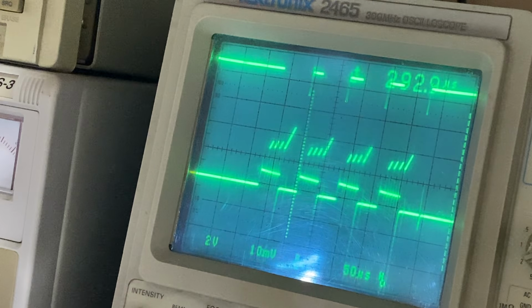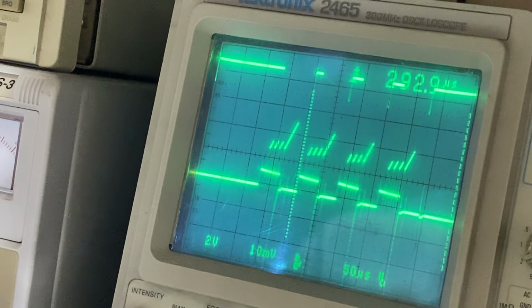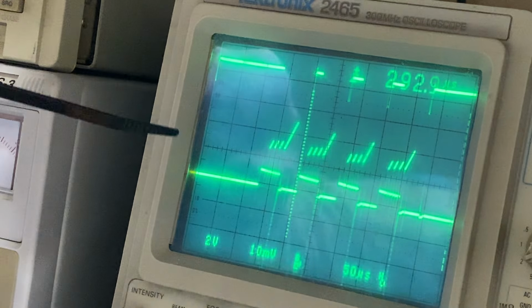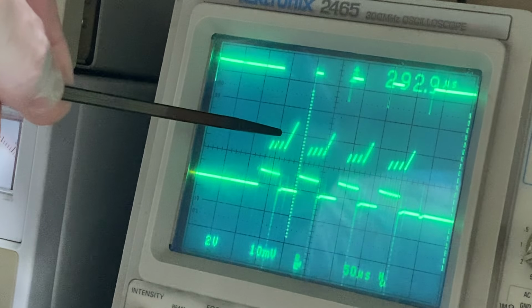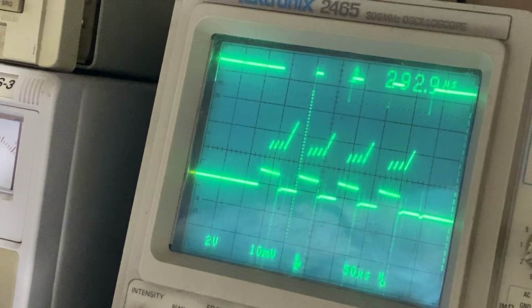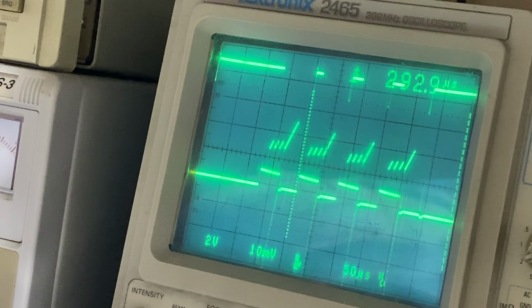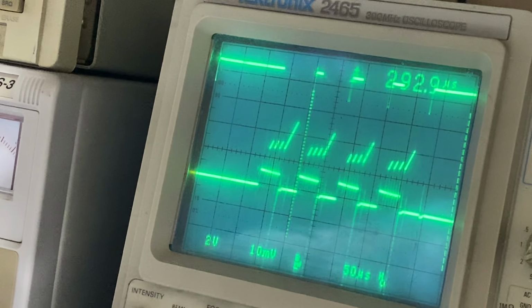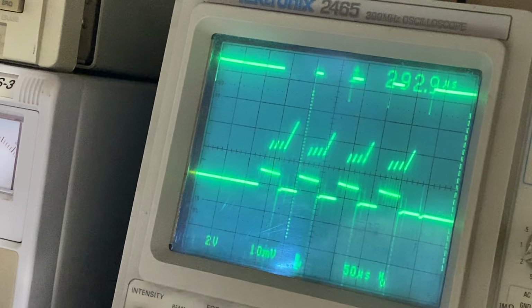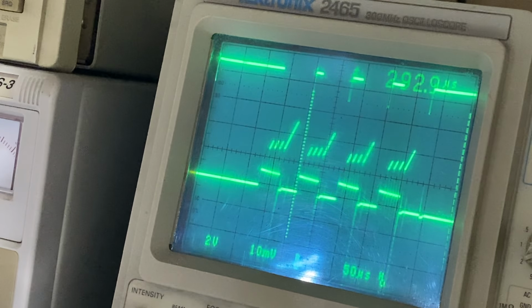Yep. And this time, if you notice, we've got that big kicker there at the end, which actually, because it's leaning over, is increasing its on time into the window here. We don't want that. That thing there, and there. And when I put my finger on this, see how it goes away. I wonder if I actually had that on the other point before, and I was going straight on the receive window, because it's an inverse of the transmit. Silly me.